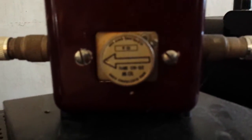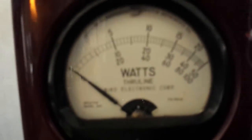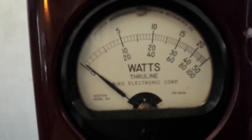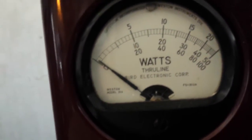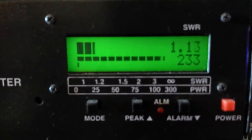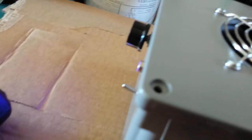Alright, that's 240 watts if you can see it. Got a 10-watt slug — this is the input tune. At the end it's 10 watts, there's that 100 marker if you can see it. Not even 100 milliwatts — 50 milliwatts, maybe 25. Perfect tune. Let's buck the voltage up to 15.2 volts and see if we can break 300 watts.